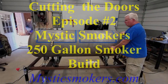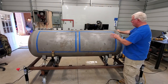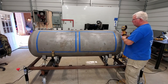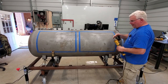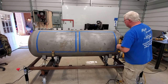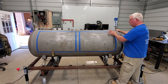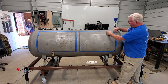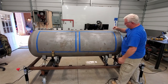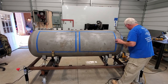Let's take just a couple of minutes to get caught up narrative-wise and explain where we're at. I have taken my small angle grinder with the 1.2 millimeter blade — I think I like those a lot better than the 1/16th. They cut cleaner and faster. I've cut about a six-inch strip on each of the runs that I need to run with my small metal cutting saw.